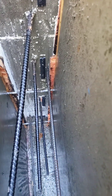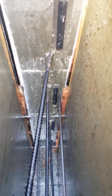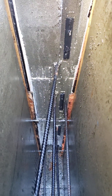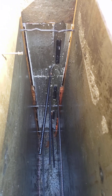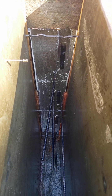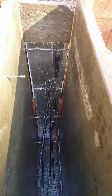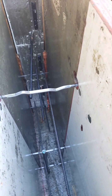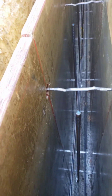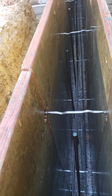You can see the various pieces of reinforcing that come out of that concrete core and tie into this wall. We'll have concrete against concrete with the reinforcing bars, plus the fact that the stepped footing goes all the way down to undisturbed soil. So that will certainly help — this thing won't be moving. And you can see the various pieces of reinforcing as we go through here.